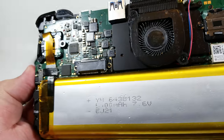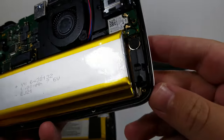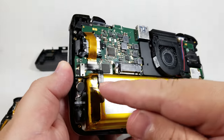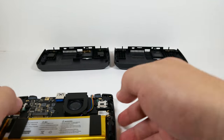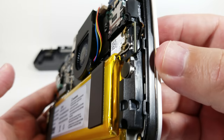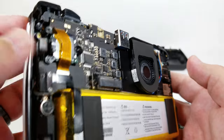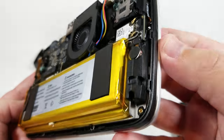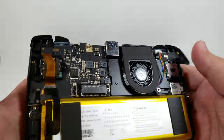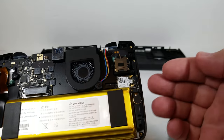Very quickly, we'll take a look at the PCB again. You can see there are little copper traces going around to fix things that were necessary later on. Here's just a blob of solder connected to this Wi-Fi antenna, and then the other antenna gets soldered over here. Versus on the retail unit, the Wi-Fi antennas are routed differently — going up and disappearing. It looks like the Wi-Fi actually goes right here and right here — just solder blobs right there and right there, which seems like where your hand placement would be. That's not super ideal. So when you're trying to get the best Wi-Fi signal, just be aware that it's on the left and right side.